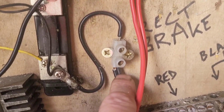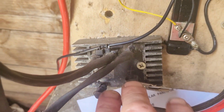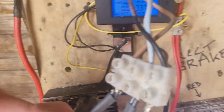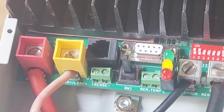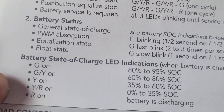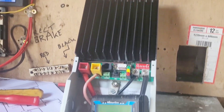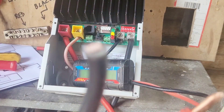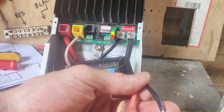I've got a broken solar panel I want to test — it should produce over 30 volts. To connect it I would simply connect the solar panel DC negative there and the DC positive there, and the meter will still do its business. With a solar panel you don't need a rectifier because it's producing DC electricity already, whereas the wind turbine is three-phase AC coming in and then the rectifier switches it over. The yellow LED is mentioned here: yellow on means 35 to 60 percent state of charge, and the meter is saying 25.89, so that may be about right.